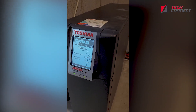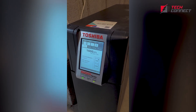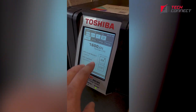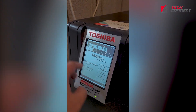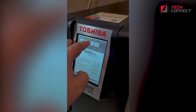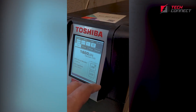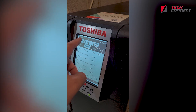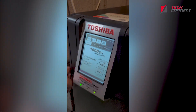This is a follow-up video on the Toshiba 1600 XPI series UPS. We've got this installed at the customer site now and are showing you a little bit of the display and seeing it run. This is the main display — you can see the lights indicating that it's online, with run and stop operations to turn it to bypass and from bypass. Going around the outside, you have the status saying online, which will change to bypass if needed. Up here is your current, and this will give you an idea of the runtime. There's no load on this at the moment, so you're not seeing much, but the menu has all kinds of data — really more than you'll need. On this front screen, it's showing you the basics of what you need to know.